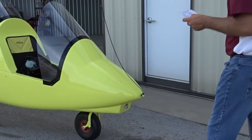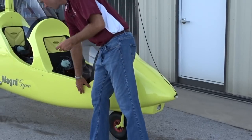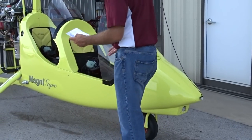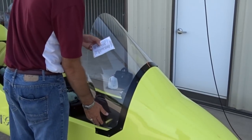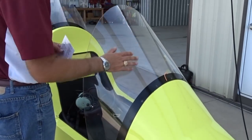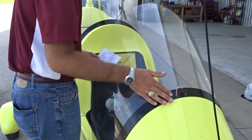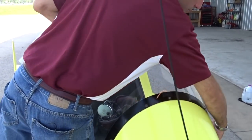Stepping back, we'll check the fuselage body for cracks. While the body's not structural, any evidence of cracks could indicate damage from a previous flight. Now make sure that the windshields are clean. Bugs can affect your field of view and even look like aircraft on the horizon. Check to make sure that the windshield screws are all secure and in place. It's a good idea to run your finger over all the screws to make sure that none of them are loose.